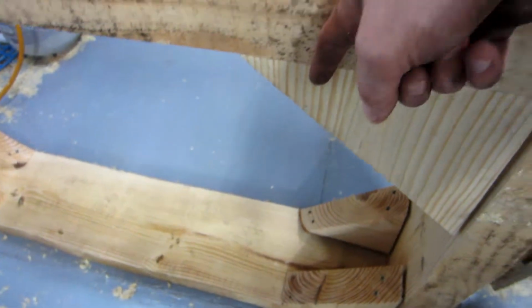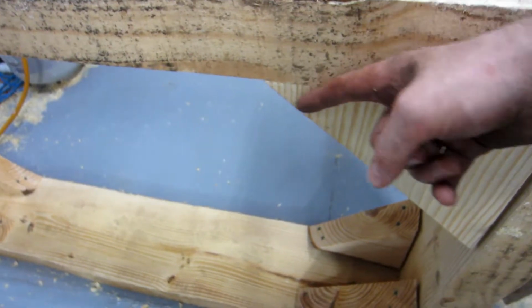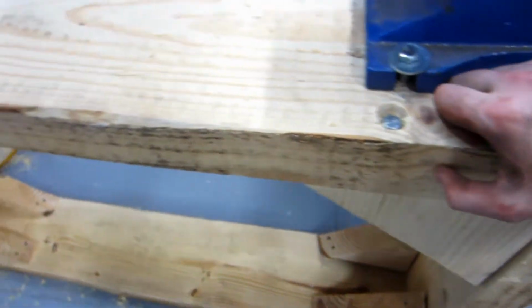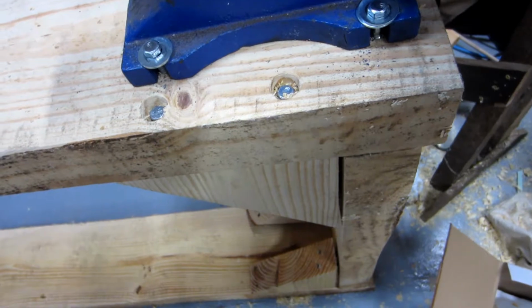And I wouldn't count on a nail to keep 2 pieces of wood together in this orientation. If you were to toenail, on the other hand, that probably would be okay. You can rely on shear strength with nails in wet wood, but I wouldn't rely on it for tension.